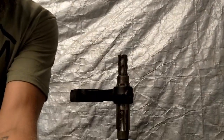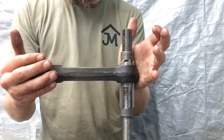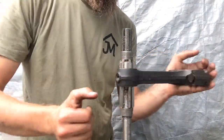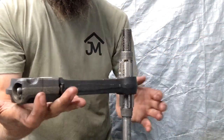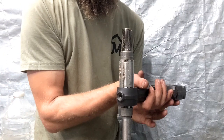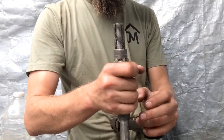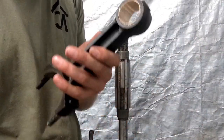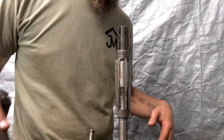Switch that angle, so you can see what's going on. See, I'm just turning these, and this is backwards of the traditional way to run these. Normally, your part would be stationary, turn the reamer. This is just working better. I think it's partially because as it's cutting, everything has fallen out better than it did when I tried doing it the other direction. There we go. Just like that. Now we're that much further. And we'll just keep doing that and adjusting it until we get it dialed in. Pretty straightforward.